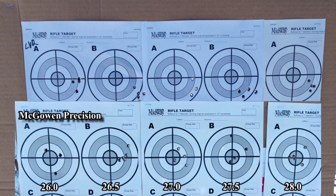What was holding this rifle back was the crown. Definitely, the gunsmith work done on this barrel was not up to snuff — they should have invested more in their quality control. Getting into the nitty-gritties, when we take a look at each individual load: on the left, the minimum charge, things start off okay, about an inch group. When we go up, things get a little tighter, and that follows with the previous range trip too. When we go up further in charge, things start to fall apart.